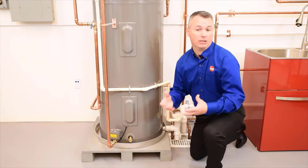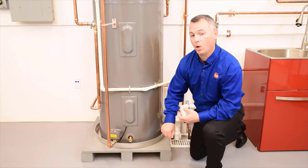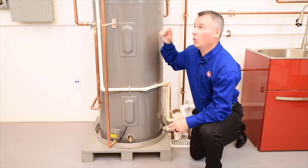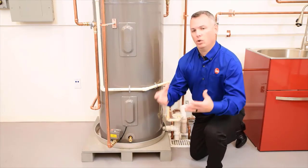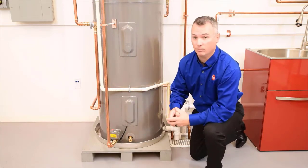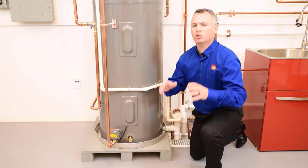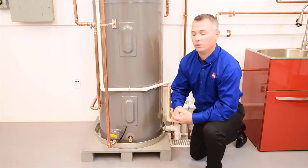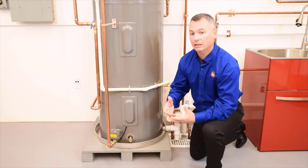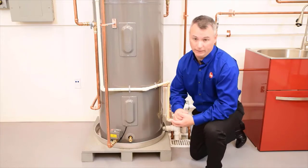Either way, by installing this water heater in a drain pan, you'll not only be able to protect the floor below from potential damage from either a tank leak or the piping above it, you'll also be able to direct any leaks to the leak detection system, which will give the homeowner the quickest alert to that leak. Just make sure that if you do install the water heater in a drain pan, that you follow the manufacturer's instructions for the pan, and that the pan is properly sized and piped to a drain.